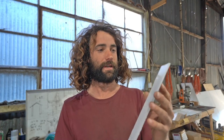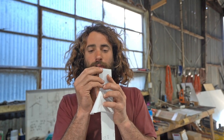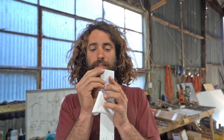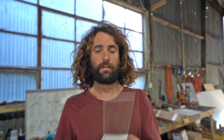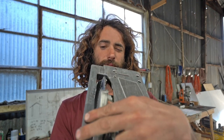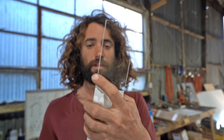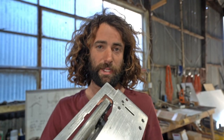The first thing we need to do is cut the acrylic sheet. This piece comes with a white protective sticker on it, and when you peel it off you can see it's very clear — actually clearer than glass and stronger, although it does scratch a lot easier. To cut the sheet I'm using a power saw with an aluminium blade. The reason is that the teeth are straight, not offset like a timber blade. If you use a timber blade the offset teeth cause the acrylic to crack along the cut line and chip off. An aluminium blade creates a much nicer cut.